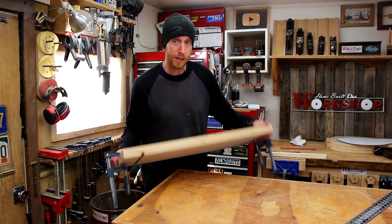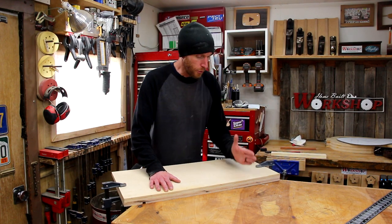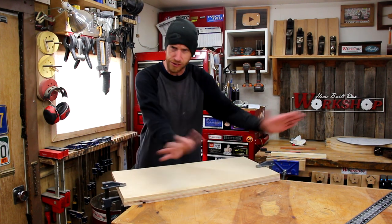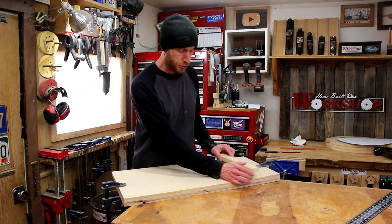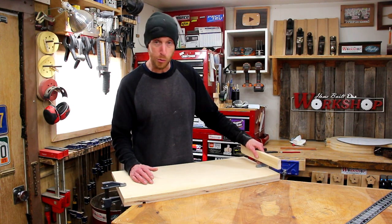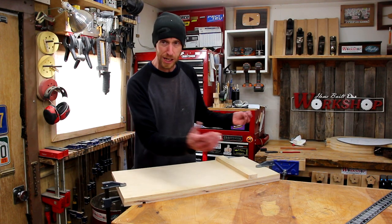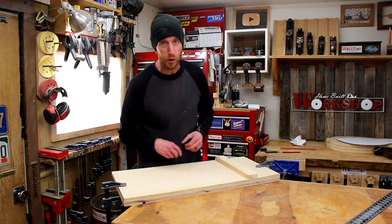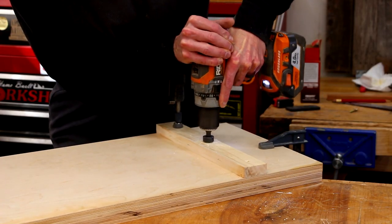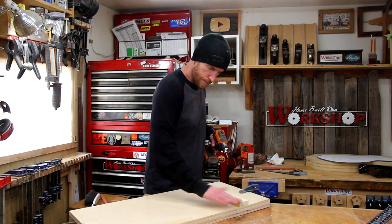While I wait for this glue to dry, I need to install a cleat on the back — it's really just going to be a bench hook. It'll hook on the side of the bench, or I could clamp it in the vise, just to keep the jig from sliding away from you. I'm going to put mine about five inches from the end. I decided to pull it in about five inches just to keep it more towards me so I don't have to reach so far when working on a smaller piece. The reason I decided to just screw it on rather than glue it is so I can move it easily if I find out this location isn't the best.